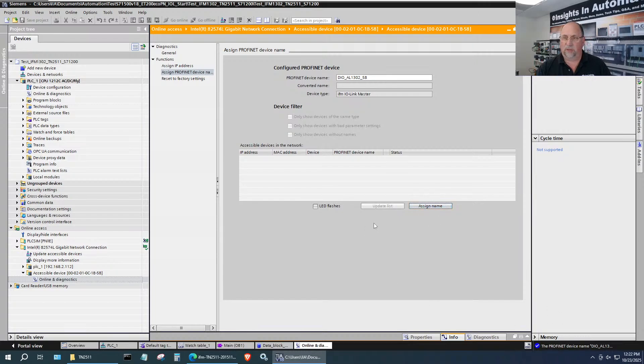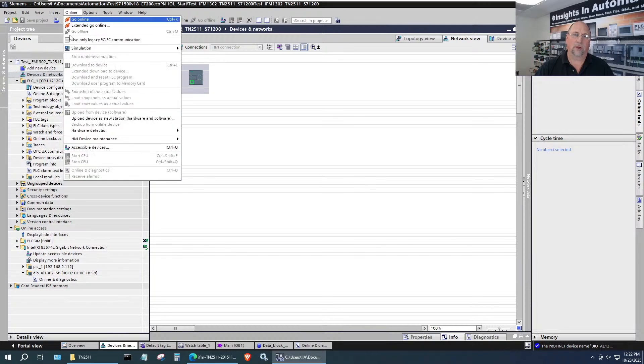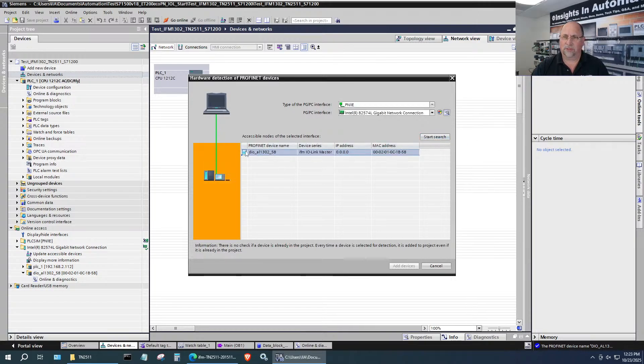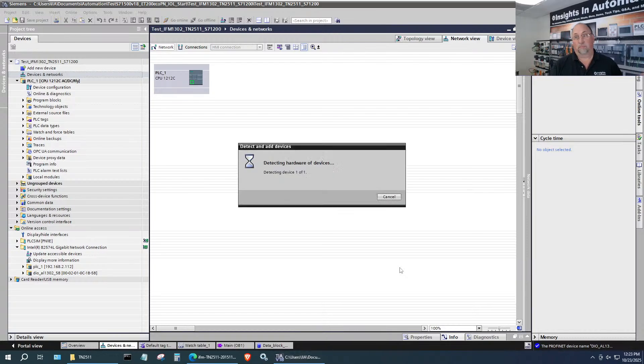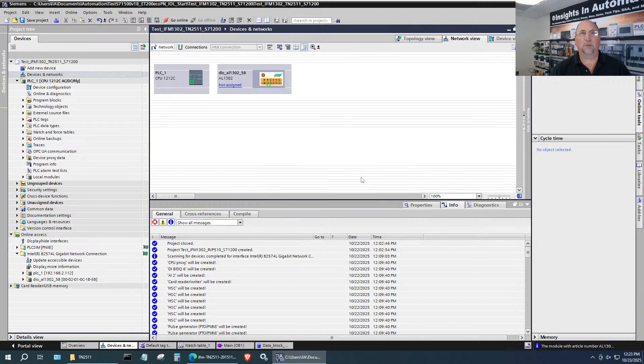Profinet name is assigned, so we're good. Going to Options > Online Hardware Detection > Profinet Devices and start a search. I didn't load the GSD file, hoping it won't take too long — on these VMs they're not as fast as a regular computer. If it's not a Siemens device it's probably not in the catalog, so you'd have to add the GSD file yourself. But because we did this yesterday, the GSD file is already there. Hardware detection of IO successfully done.